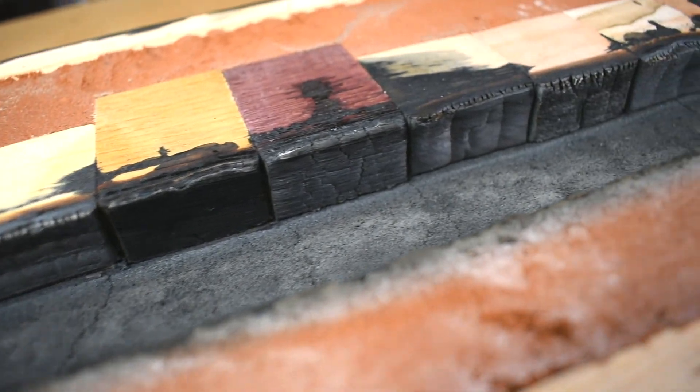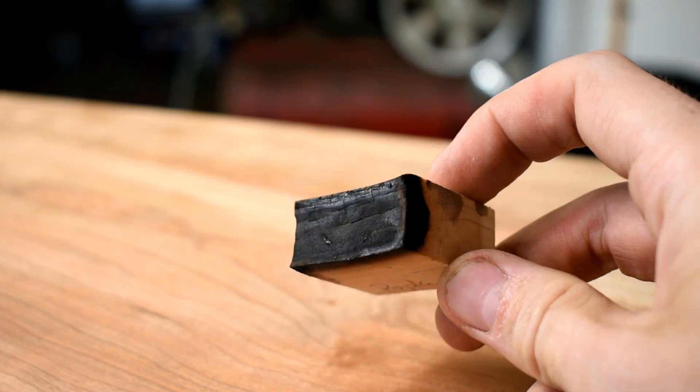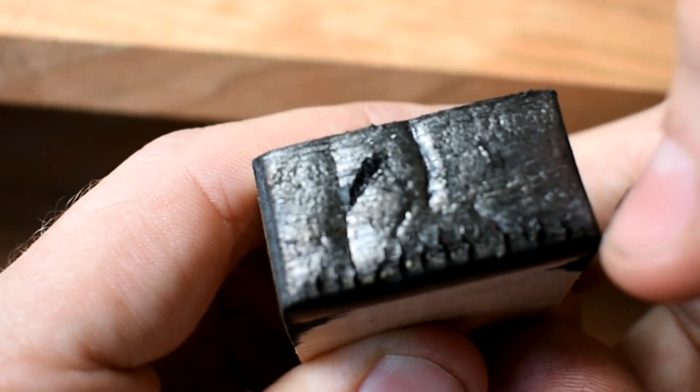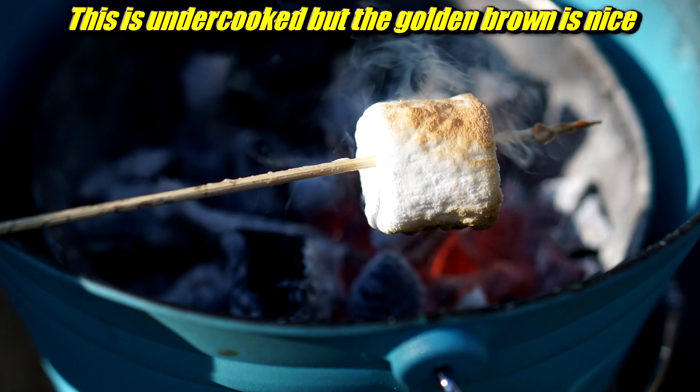I need to figure out a way to rank these. I first just looked at them to see how screwed up they looked — how the burn mark kind of sunk into the wood and how far in it had sunk. Then I did a thumbnail test: poke your thumbnail into the charred bit, how easy is it to make a dent, how deep can it go? Is the charred bit like styrofoam or is it still solid wood? Some are still rock hard and some had the consistency of a burned marshmallow.